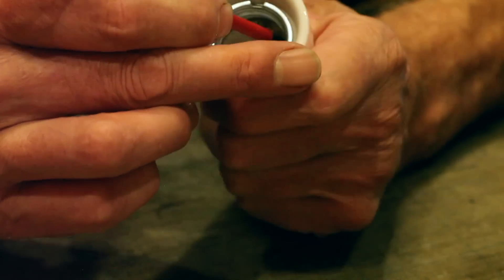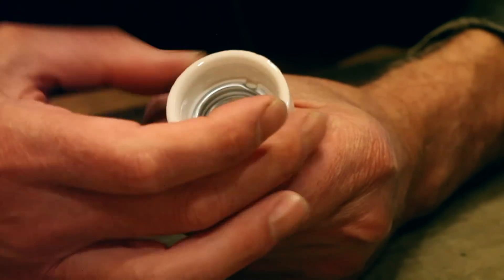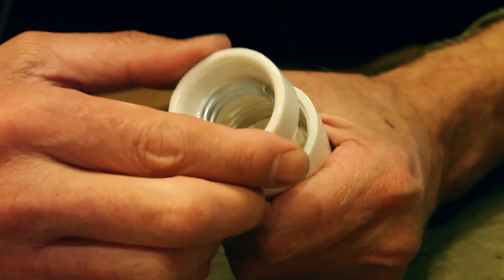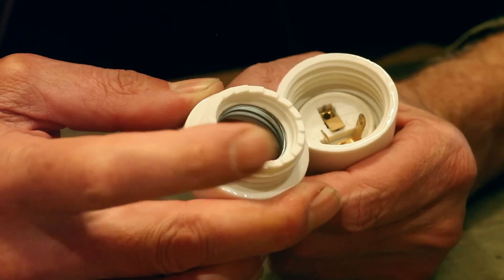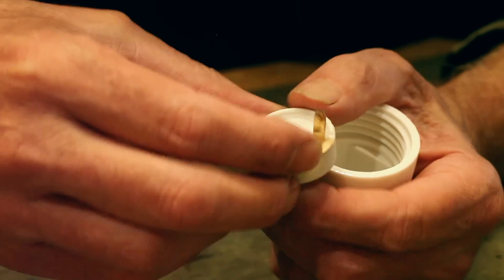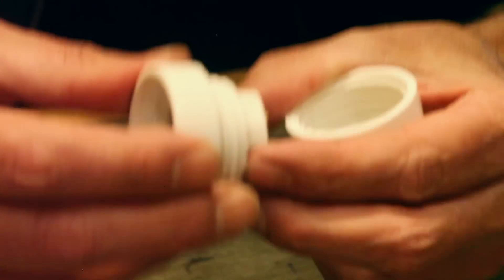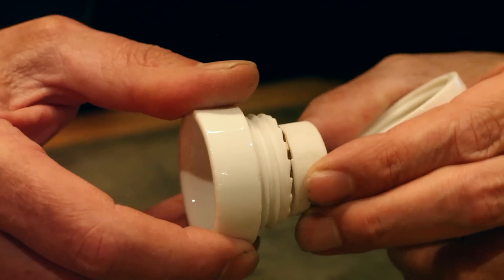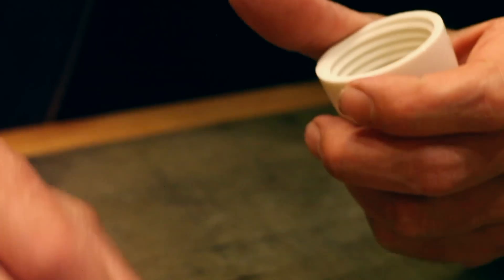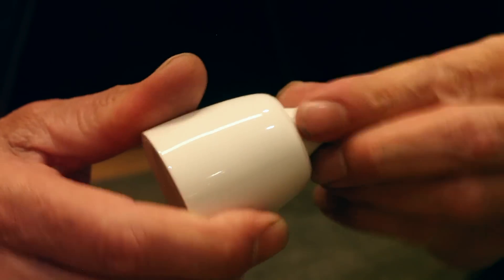It's a little difficult to see, but as long as you look for it and use a small screwdriver, you'll be able to push that ratchet down and it will release. The ratchet component is on the ceramic, and on the connector there's a little bit of steel that stops it going the wrong way — it'll go one way but not the other. That's the safety feature that makes this lamp holder safe so it can't be undone accidentally.